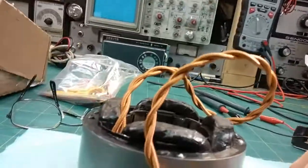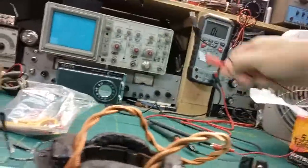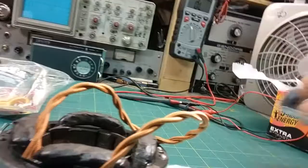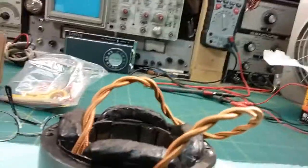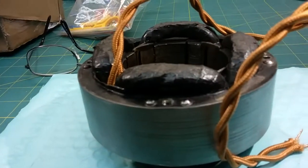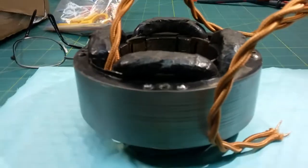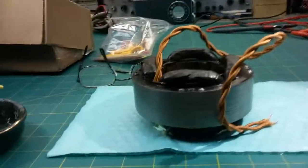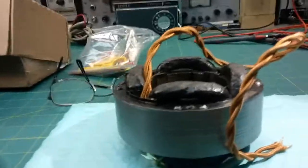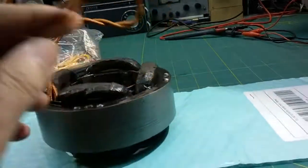And you see we have 26 ohms, give or take an ohm or two — the meter not being zeroed out very well. So it's roughly 20 to 40 ohms, somewhere in that range, and you know you're okay. If you get like 1k ohm, you've got a problem. If you get an open load, you definitely have a problem. Okay, that's the first step to check the coil.